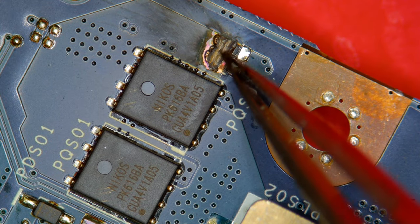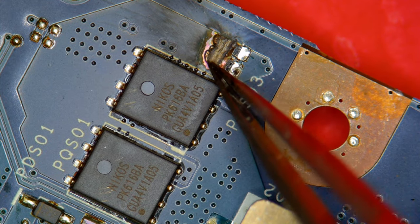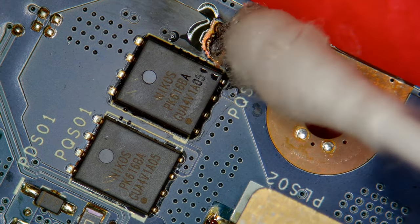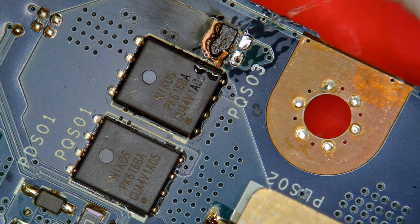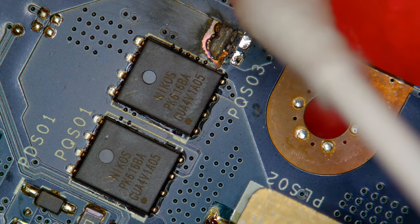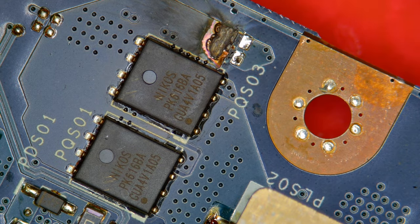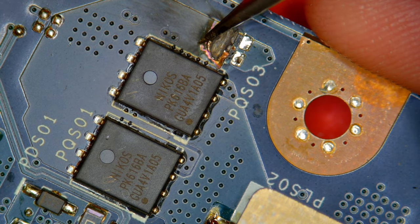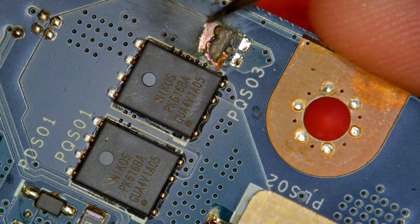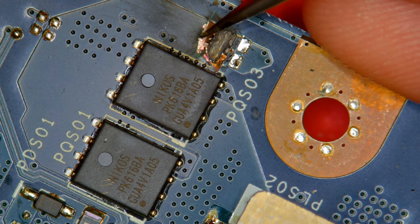As you can see, it's actually burned through the first layer, and that is the board underneath. There's not much charring — it is a bit filthy, but this is not any major damage. We can put a capacitor on the other end and then solder a wire to the capacitors. We'll just take off a bit more of that copper and then we should be good. You can tell it's really weak because I can use my tweezers to cut it off, like such.